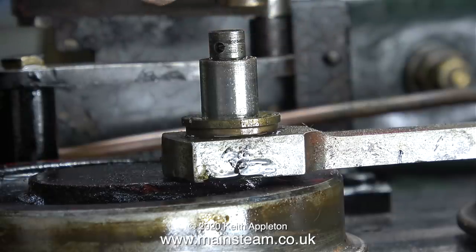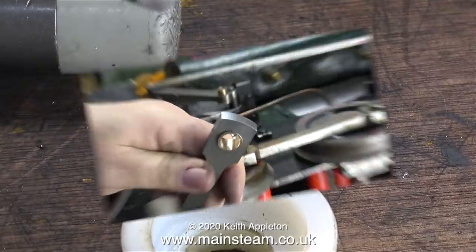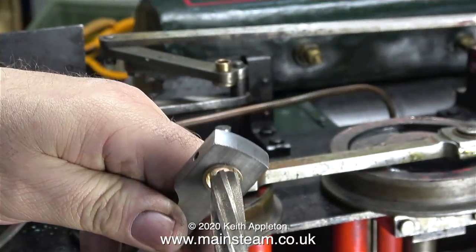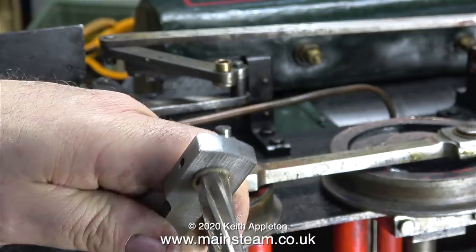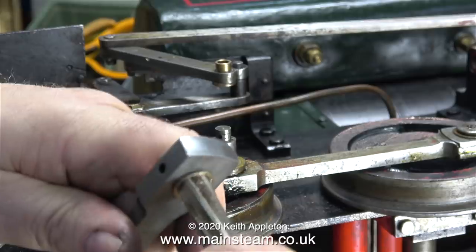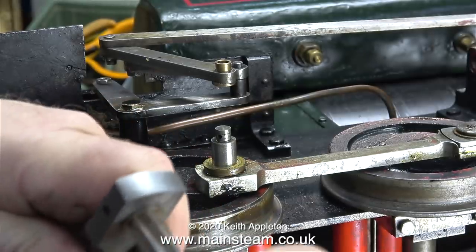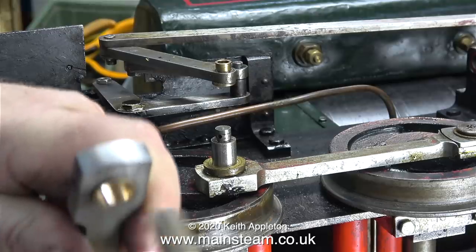It's ultra-violence time! I could have used a hydraulic press or the vice — I used a soft hammer, but the outcome is the same. The bush is made from phosphor bronze, which is softer than steel. Now it's pressed into the connecting rod it's too small to fit on the crank pin, hence the need for a bit of gentle hand reaming.